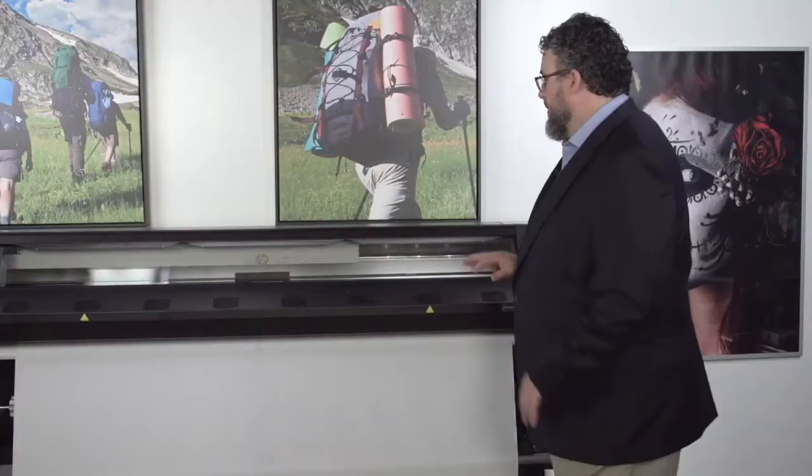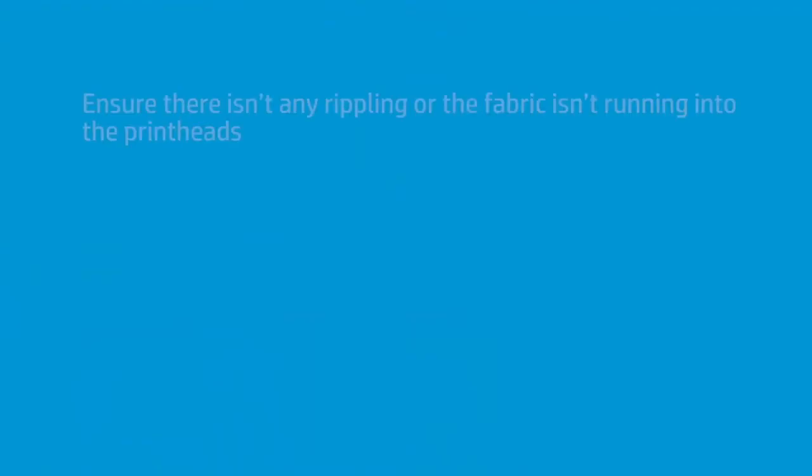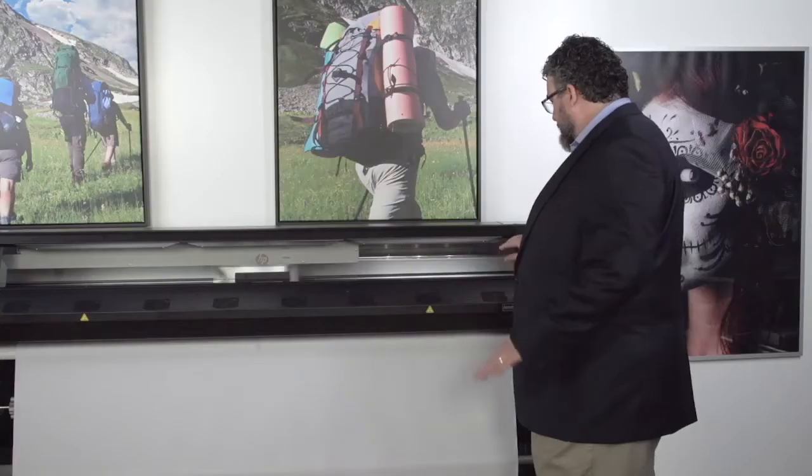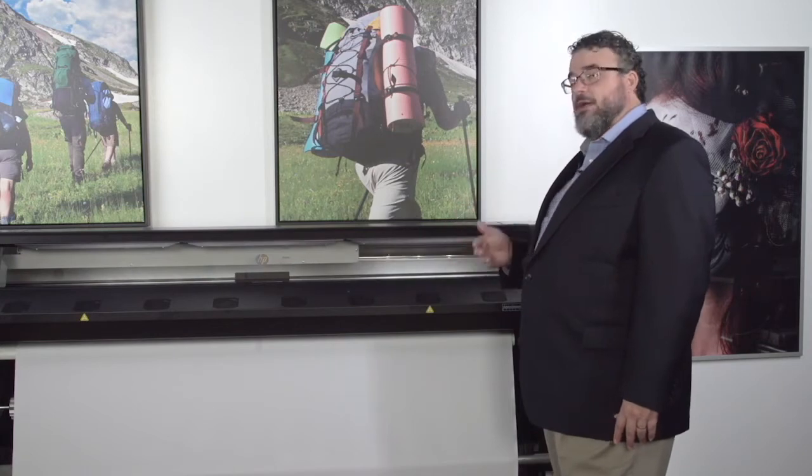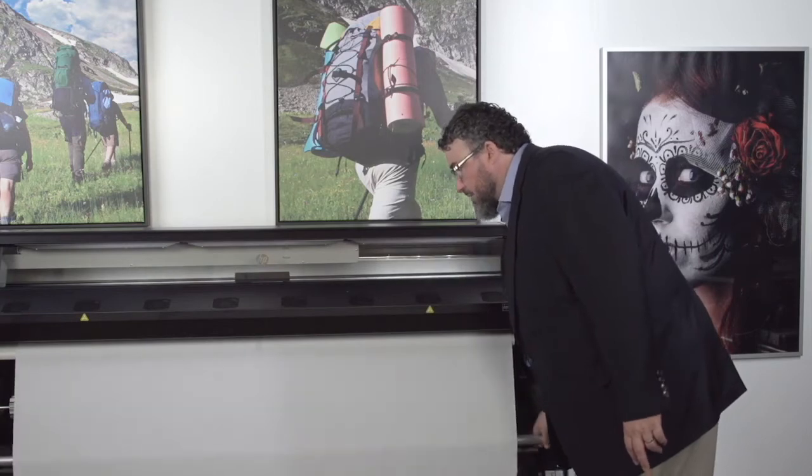But this generic 200% — very nice. For the most part, that's my go-to and I've been very pleased with it. While it's printing, I'm looking at it very carefully. I want to make sure that these edges and any sort of rippling is not going to be a problem. I'm watching carefully to see if the print carriage touches the fabric at any point. If I run it for a while and I'm confident everything's good, I'm generally going to walk away — I don't do a lot of attended printing. These printers are designed to run very unattended, provided you take the time and put everything on the rolls correctly. Most problems with the mechanical feeding of soft textile are sort of a human error kind of thing.